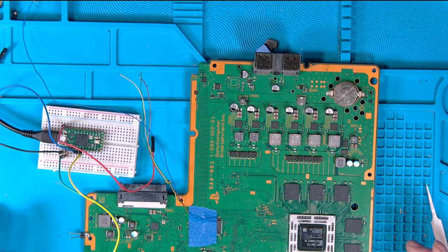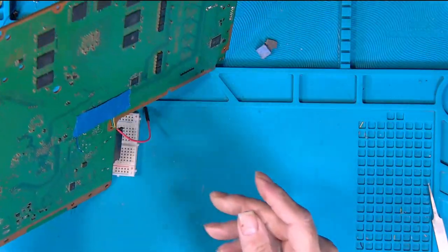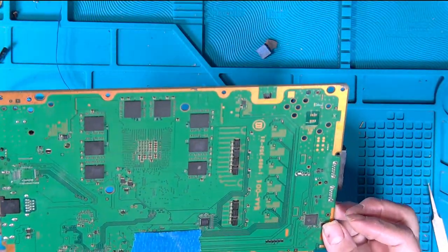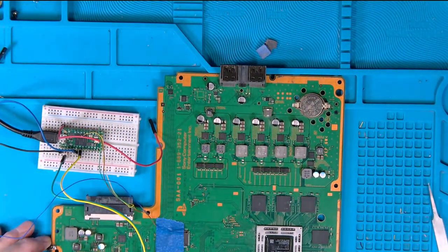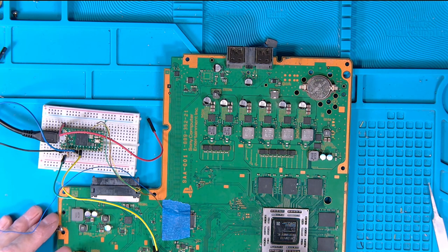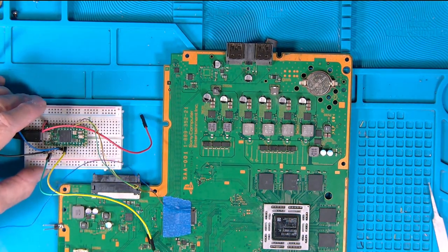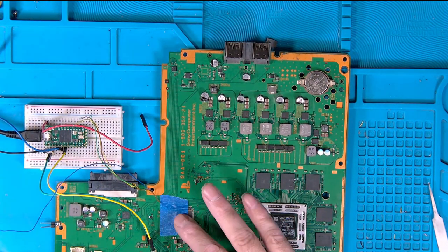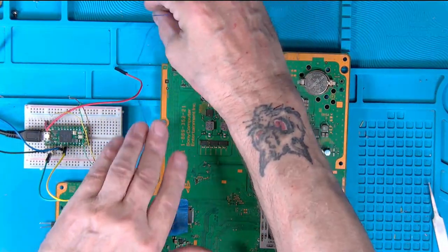You can have, even though it's got the HDMI chip missing as well, and there's lots of bits I've seen missing off the board. But as I say, you don't need a great deal. You only need the 3.3 volt running to read the UART, to read the Syscon. And at worst, if you can't read the UART NOR on the board, you always lift it off and read it. It's good practice, and it'll give you more confidence when you tackle a board that's worth a lot of money, or somebody's pride and joy.